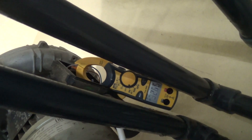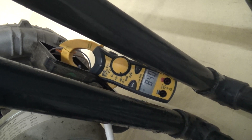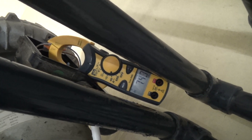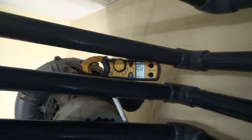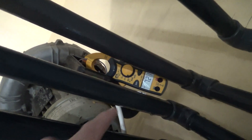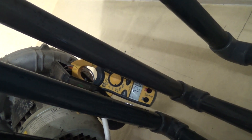Okay, got that capacitor in there. It takes a while - it's got to get up to speed, and then it's got to push the spray rail from it, which goes right the way down to the bottom, all the way across, and then runs across in parallel paths. So it's got to push all the water out of that before it can start pushing the air through. I think that's why it takes a while for the current to drop down, which is probably why it blows the fuse every now and again - because you can see it pull 32 amps when it comes on and it's only a 16 amp fuse.